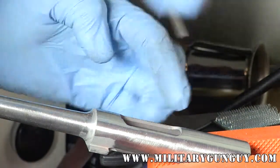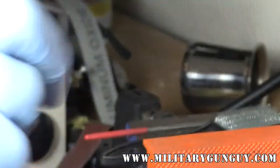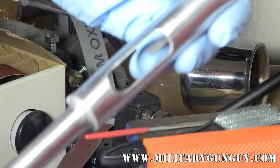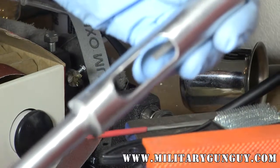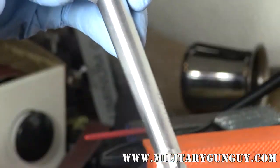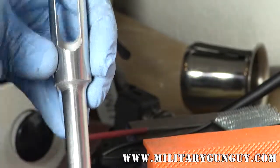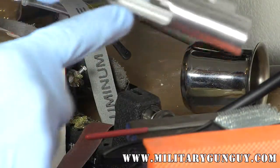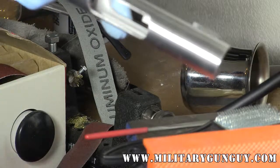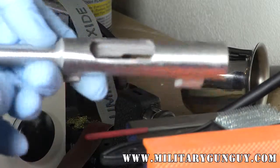This small nick is not going to affect the operation of the pistol, but it may show up in the finish. What I'm doing is cleaning up this lip right here — there were a couple of areas that are slightly uneven. I'll put more of an edge on that with the file, clamp it, and just keep cleaning it up until I'm happy with it.